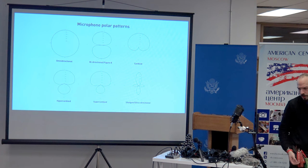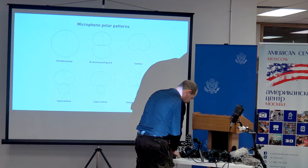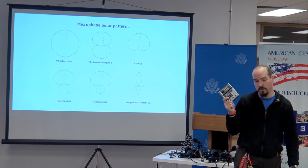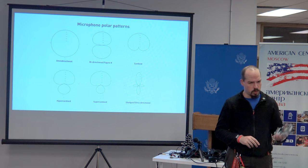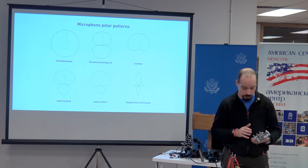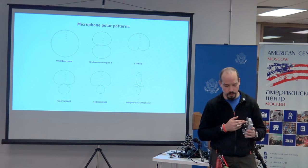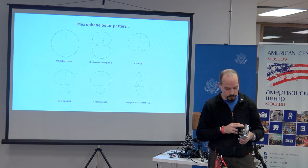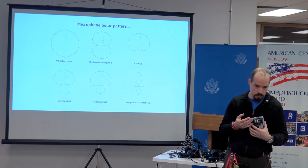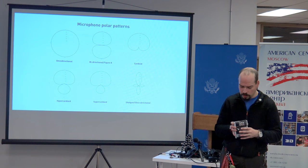So, enter audio interfaces. This thing here is probably one of the cheapest audio interfaces ever. It's also portable, and it doesn't necessarily require a computer. So you can plug in a proper microphone, and it automatically detects if the microphone needs phantom power or not. So you plug your microphone into that. There are bigger models for more microphones and more inputs and outputs.